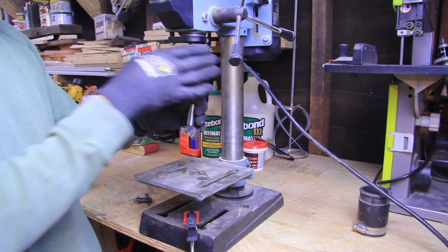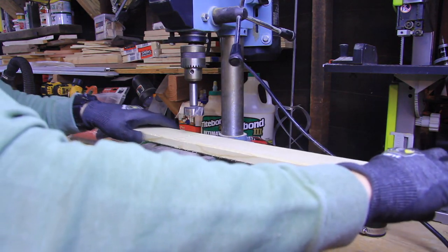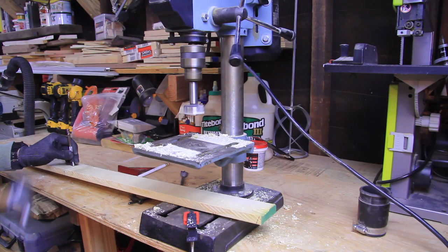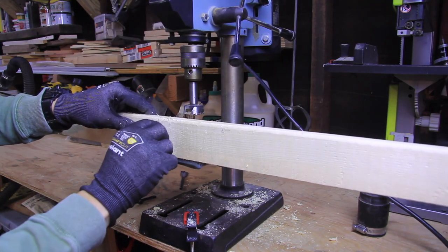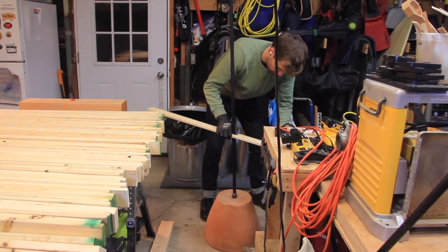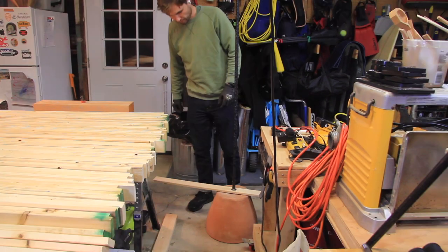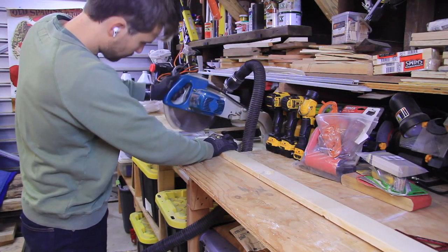Once I had finished transferring the lines and starting the holes, I went over to my drill press and installed a one-inch wide Forstner bit. Before drilling all of the holes, I wanted to do a first test piece, and I ended up having to do the hole punch on the opposite side of the 1x3 so I could do a complete hole through. The very first 1x3 will actually sit over the coupling used to combine the two pipes, so the hole needed to be just a little bit wider. It worked, and then it was time to move on to cutting that first piece down to the right length at the miter saw.